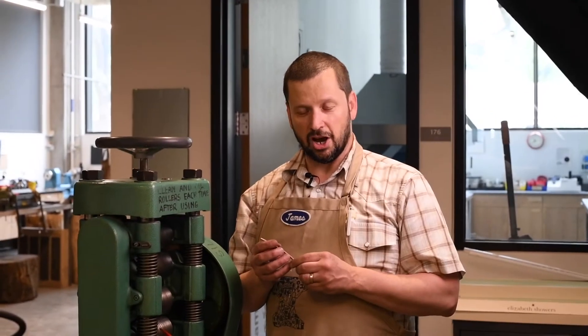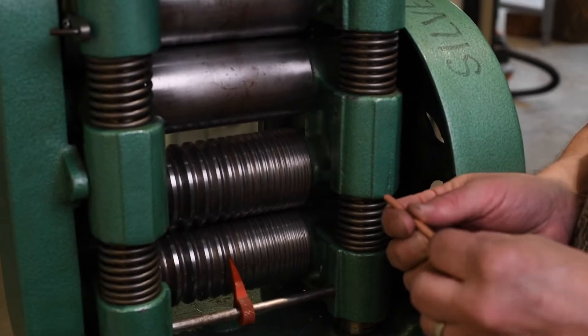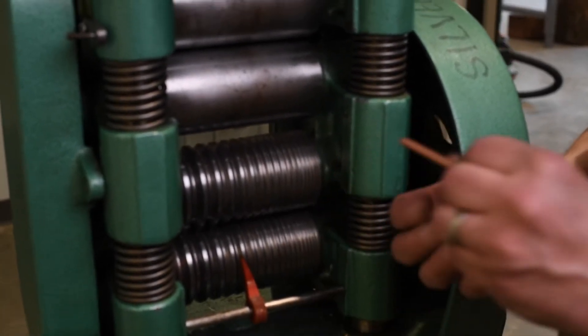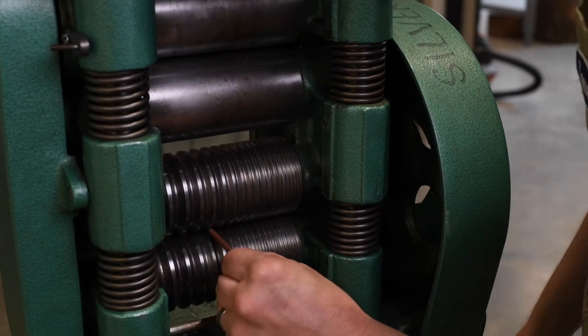Now I'm going to show you the bench tip from Alan Revere about step rolling, to help with the transitions in your taper. For step rolling, you get the rod all the way square and then work down to the smaller areas, but don't roll it all the way through, so that it starts forming the taper for you.